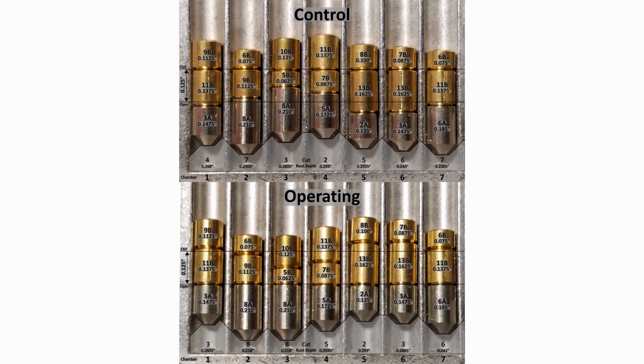Now consider if this lock was master pinned, we would have 4 pins in one or more of the chambers. In some cases you might think that picking to multiple shear lines is easier. That's true with standard locks, where we don't have 2 shear lines. You can pick with a master key. It makes it easier to pick, but here it can actually add confusion, because let's say this number 11 pin was split in 2, with a number 4 and a number 7 with it, that would make 11 total. Then they would actually have more shear lines in here.